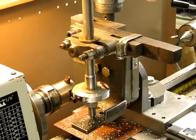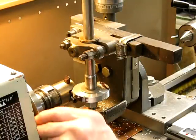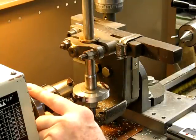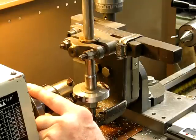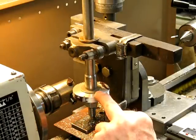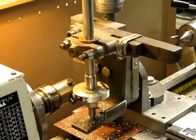That was spinning at 1100 RPM. When I used the involute gear cutter, I was spinning at about 650. I wouldn't go any faster than 1100 because you're going to get a lot more vibration — the shock loading is going to be greater. But I've sped up the lathe to make it cut a bit quicker. And as I said, that's the one downside of the single point cutter: it is quite slow.